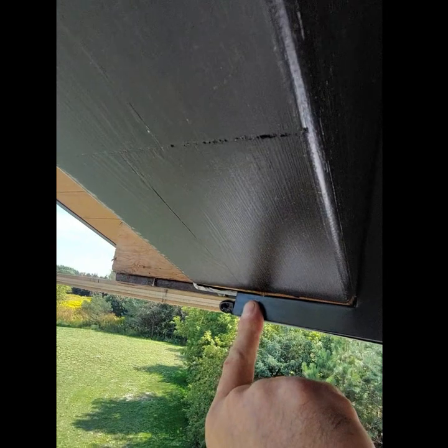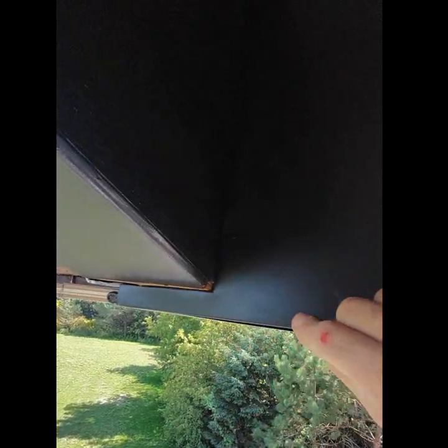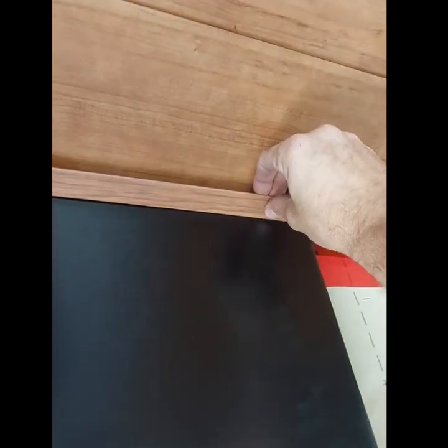This will all prevent anything from falling out until the caulking is fully dried. You can see where my caulking joint is behind — putting caulking along the edges on the ribs also prevents oil canning. That's one of the three pieces going up to do the full beam. I added a piece of woodgrain coil stock that just slid over that lip, removing the two-way tape backing to hold it firm in place.